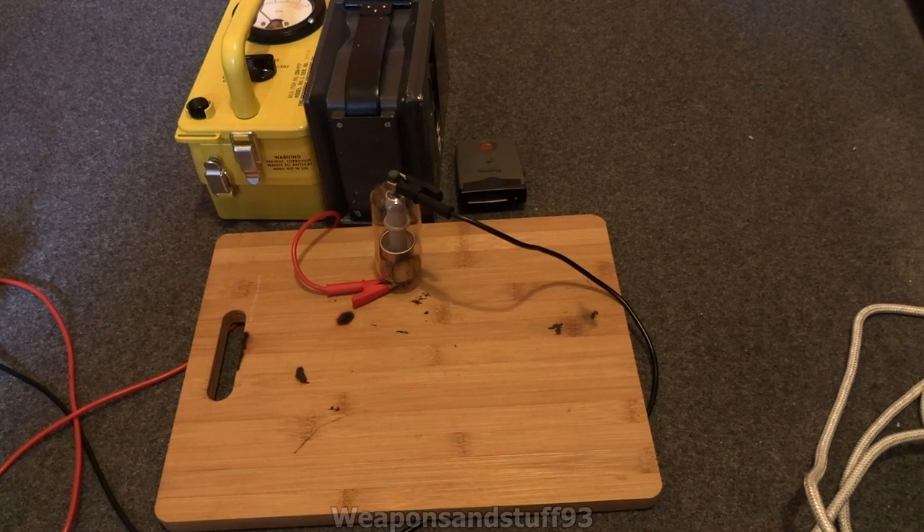I'm not going to heat the filament up, but I believe it would give off even more radiation if I did. These generally are meant to run about 25 to 30 kilovolts in most old colour televisions, but they could run higher. The higher the voltage going into this tube, the harder the x-rays it emits. If you had 30 kilovolts going in, you'd get about 30 keV energy coming out — that's kilo electron volts. If it got close to 60 kV, you'd get 60 keV coming out. The higher the number, the harder the x-rays, the more dangerous and penetrating they are.